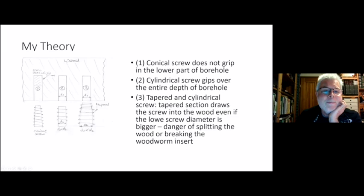It's just a theory about how big or how wide holes for woodworm screw chucks should be. In the beginning they had these conical screws or tapered screws like normal wood screws, and the problem is if you drill a hole and the screw is tapered, it won't grip in the upper part of your hole. So you lose the holding power up here and you have to drill a rather deep hole to make the conical or tapered screw hold. So this doesn't work very well for a shallow hole.